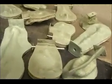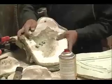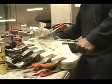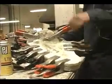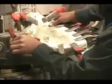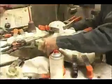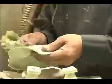The first step in the process is to make a silicon rubber mould of the original master frog. The mould is then injected with hot liquid wax. When it's cooled down, it is removed from the mould, then cleaned and polished to remove any defects.